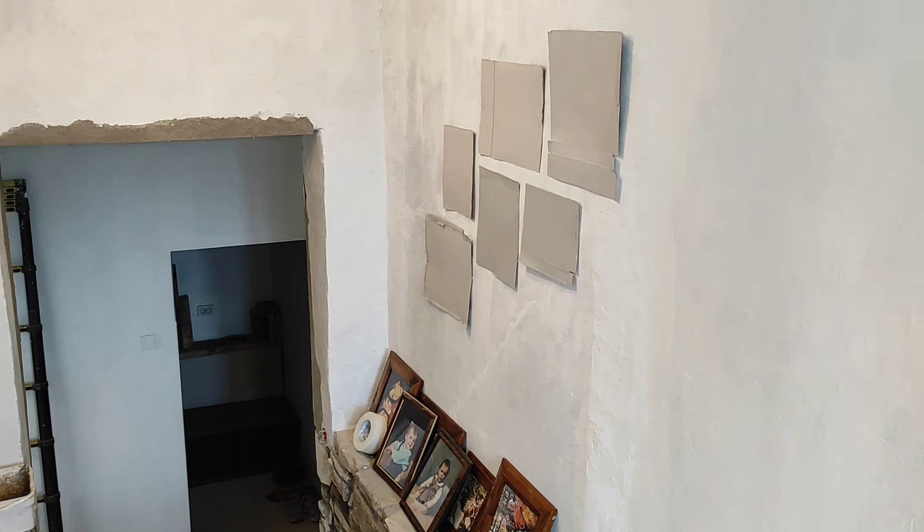You can see how we've managed to get rid of that little void that the plasterboard had against the chamfered rounded area of the old finished bit, so now we've flushed it all off. That's currently drying. At first glance I'm actually super happy with the way this has been built up. You can see in the earlier part of the video where it was always chamfered, but now it's looking super smart — and same on this corner. We've just got a little bit left to do. This is like a first scratch coat everywhere around the house. The final vision will be the whole thing plastered with a smooth sharp-edge finish with all the corner beads done. We're trying to make it as best as we can, lock in all the dust, seal it all and get everything as close to final finish as possible. You can imagine when it's all matched with the corner beads and the skin plaster, it will look super sharp.